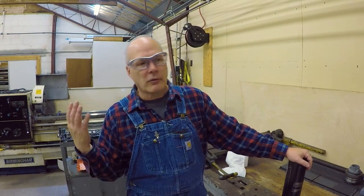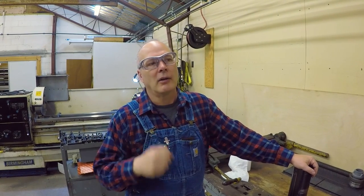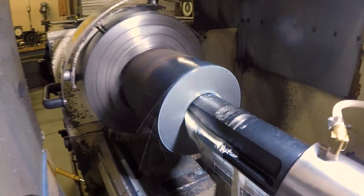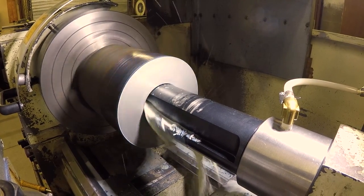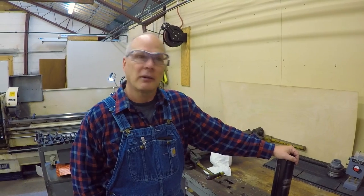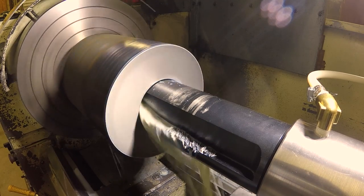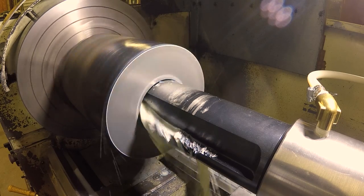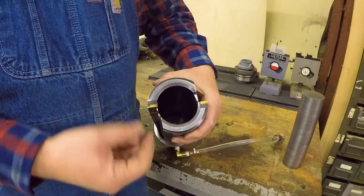This thing will run about two or three times that RPM if you want to. You should have as much coolant as you can get, mainly because the coolant runs in here through the center and then comes out and forces the chips out — literally like an oil surge. The more pressure you've got on the coolant, the faster the chips come out, the faster you can drill a hole, and the less pressure there is on the inserts. If you think about making an internal one-inch cut at 5,000 surface feet per minute, that material has got to go somewhere fast.